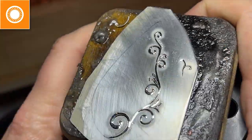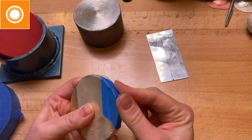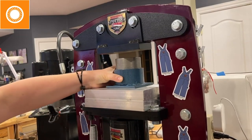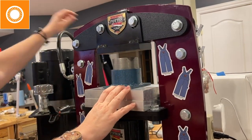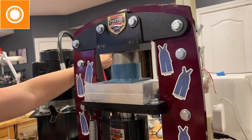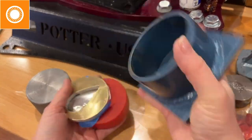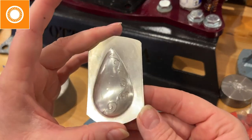Once I have it, I just remove any surface scratches. Now I'm going to put it into the die and form it, but I don't want it to shift so I tape both sides. If you only tape one side it will drag in on the free side. When you put it into the hydraulic press, make certain it's completely centered for the best pressure. I took this up to about 3,500 pounds - I didn't want to go too high and risk popping it. Because I've already engraved it, I only get one shot to get the depth right.